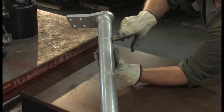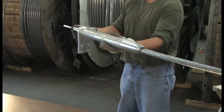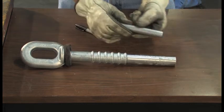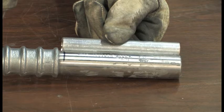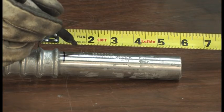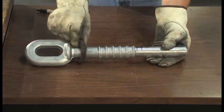Now take the outer sleeve and locate the three start and stop marks. Mark each of them with a marker. Place the outer sleeve over the conductor, narrow end first, and push it back out of the way. Remove the aluminum insert from the steel forging. Hold the insert over the outside of the forging lining up the ends, and make a mark on the forging at the end of the insert — this indicates the actual depth of the insert. Next, measure a half inch from the first mark towards the forging end and make a second mark, called the start mark. Replace the aluminum insert back into the steel forging, and be sure the felt washer is on the forging by the eye.